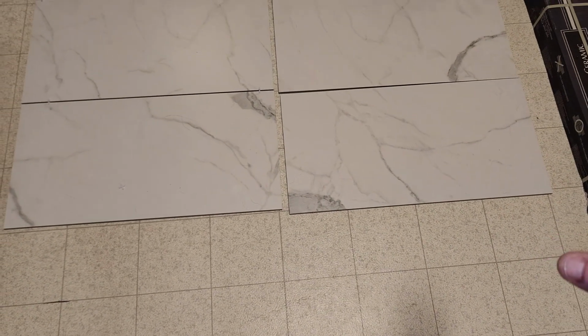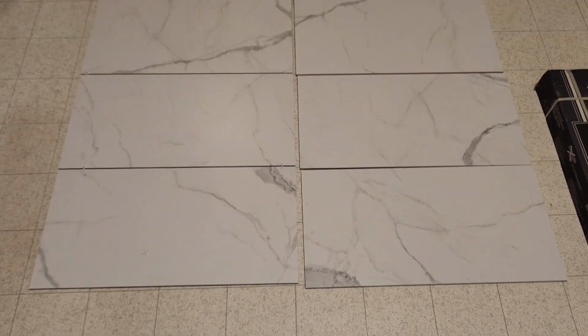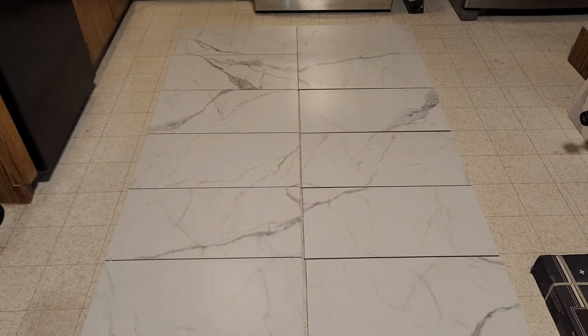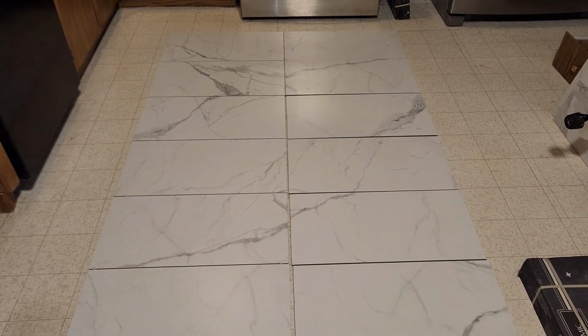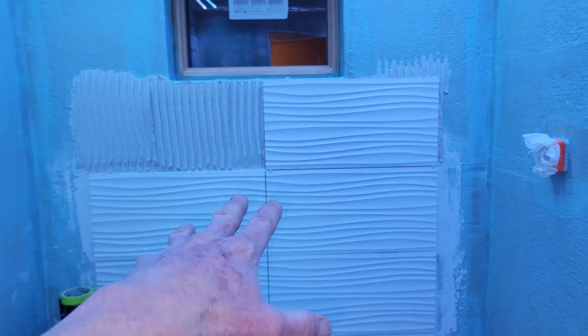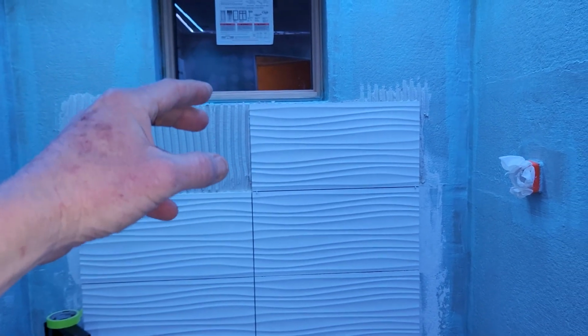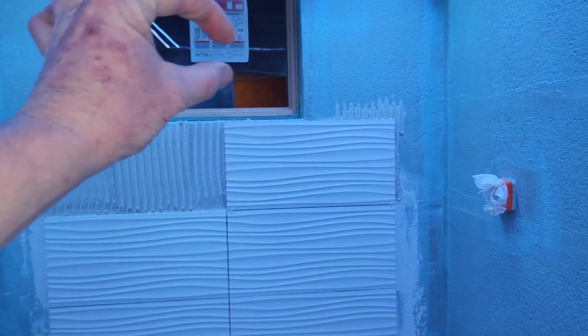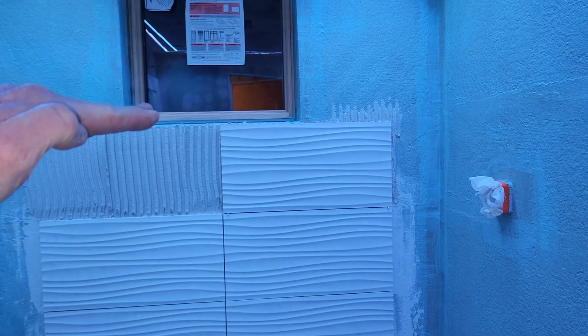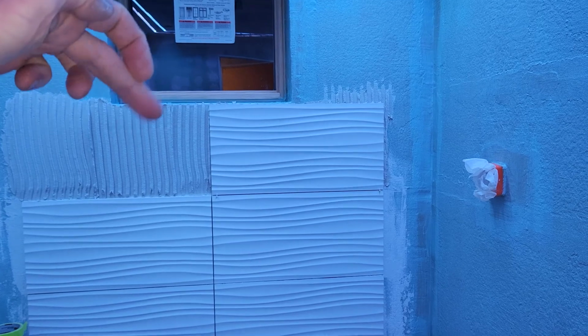And then right behind the bathtub, you're not going to see that, will be a small strip of tiles right there. So doing a full wall without a window, definitely easier, but I do like a window in the bathroom. All right, now we're on the top row. I've checked my levelness. We're beautiful. We're looking absolutely fantastic. My math is correct with my grout line, and then we'll have my little slightly down degree. So if water gets on top of the windowsill, it'll flow down.